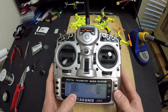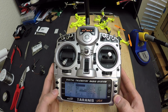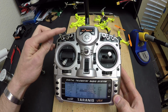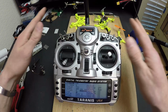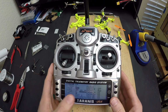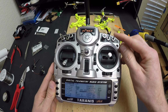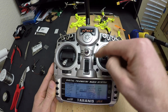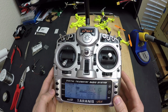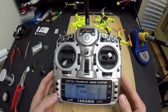And now, so that's going to be my ARM and disarm switch, and then I'm going to need my auxiliary 2, channel 6. I'm just going to come in here, and I'm going to do source, and I like to have this one for my flight modes. You can, of course, pick any switch you want to. If you select it and you're like, oh, wait, shoot, I didn't want SB, I wanted SC over here, you can easily just click it that way and see how, when it's blinking, it's trying to sense what switch you want, then you can set it that way. But for me, I like SB, so I'm going to select it again. I'll switch it back to SB. All right, and now we can go out.